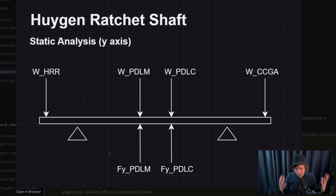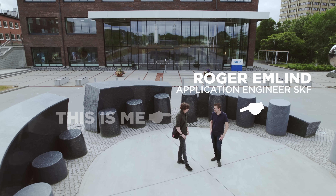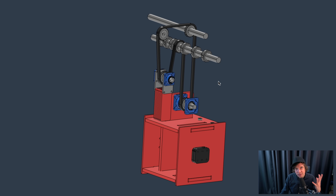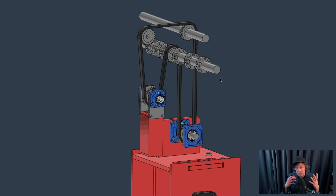The idea is to put your design requirements down on pen and paper and check if you can achieve those design requirements on pen and paper. The more I'm trying to learn this, the more I realize that if we do not have the design requirements written down, we have nothing to discuss with each other. Several times during these weeks talking with engineers on Discord, I hit this wall in the communication where I realize: if I haven't stated the design requirement, there's absolutely nothing for us to discuss. Everything else is just conjecture and basically a waste of time. When I went to SKF and met with Roger, he went to this 2D realm immediately - that's where Roger wanted to discuss the choice of a bearing. We should iterate as much as possible in spreadsheets and 2D diagrams. It's taking me surprisingly long to truly understand that it's the design requirements that will design the machine.